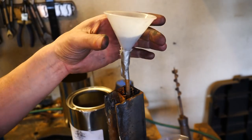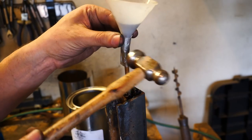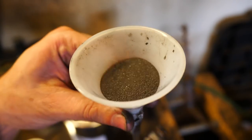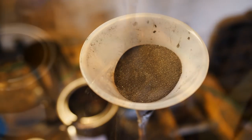This brass tube seemed like a good idea but I'm not sure it really added much here at all. The powder seemed hesitant to clear the bottom of the tube, and most of the powdered steel ended up being added just directly to the canister without the help of the brass tube.